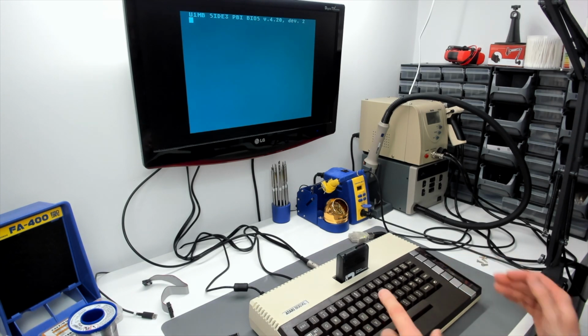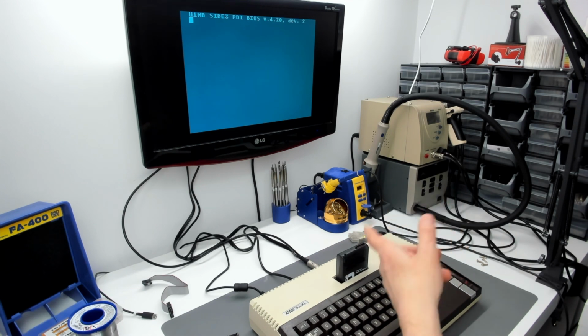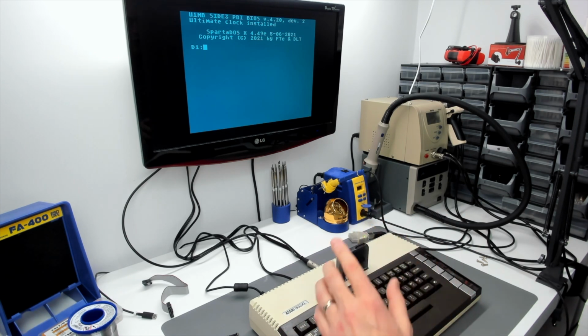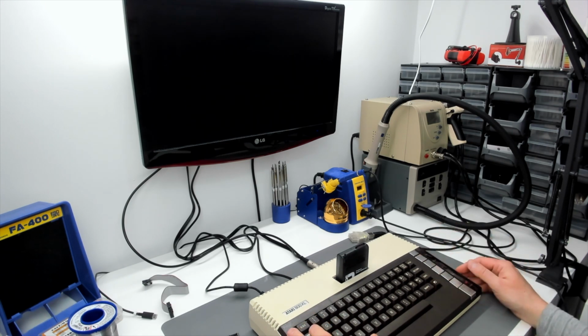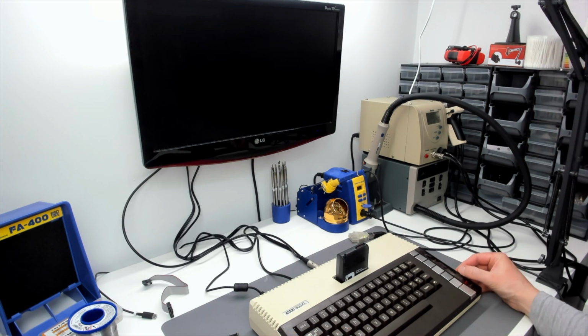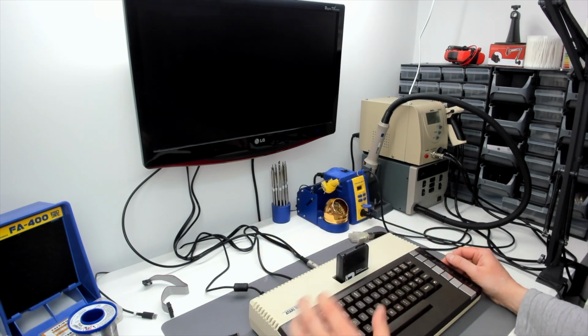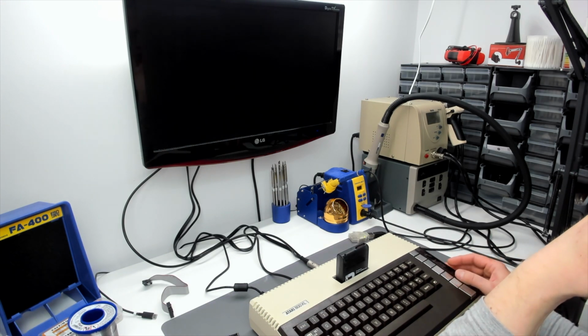It is, right, so I've turned Rapidus off, even without the plugin, by basically pulling the ground connection up to 5 volts, or 3.3 volts. I can't remember what it is. Logic 1 anyway. So now if I press the reset key, oh dear me. Yeah, you know what? That bug absolutely stinks. I thought I could get around it by just disabling Rapidus in software, but no.